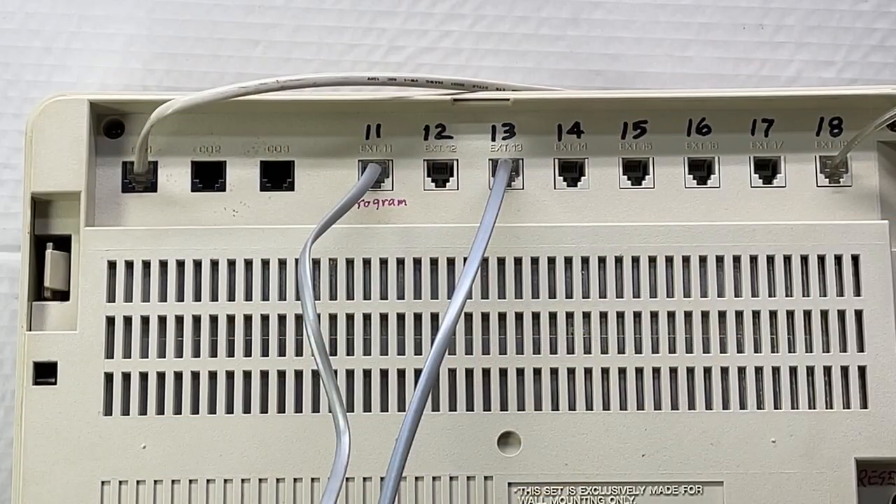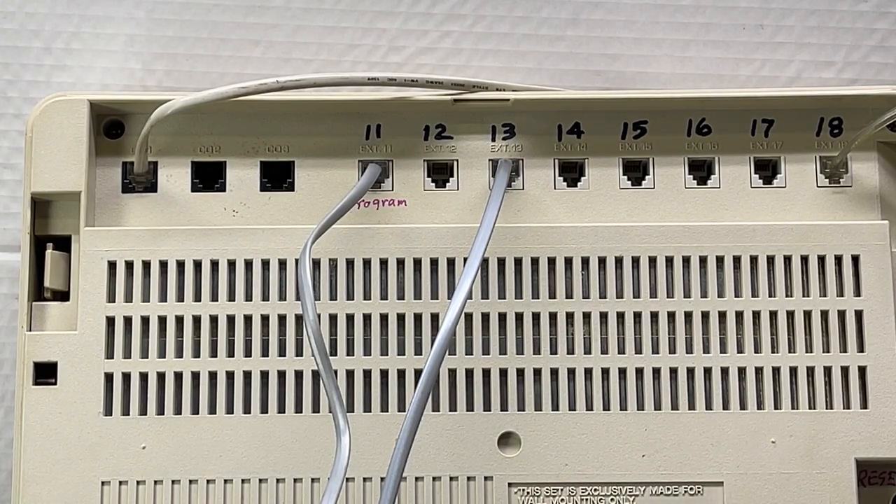These control units — referred to as KSU, key service unit — must be wall mounted for ventilation. Do not lay them on a workbench forever. For a quick test you're fine as long as you have the cover open so the electronics can breathe and you're not in an incredibly hot environment. Do not put this in an enclosed cabinet where it'll get super hot. The system is also not intended to be turned off and on, and you will kill the system if you turn it off and on repetitively. The power consumption is insignificant, and if the power bill is a concern for running this unit then you just shouldn't have the unit.